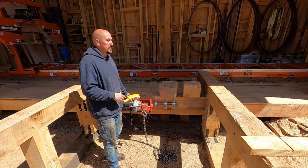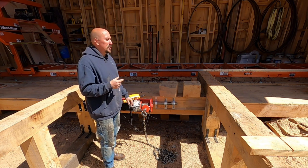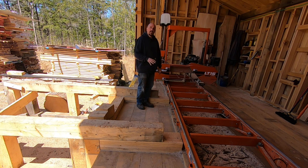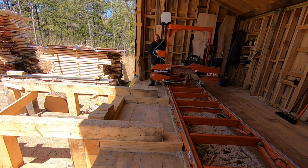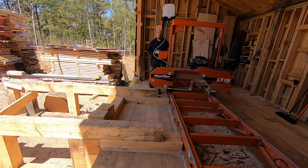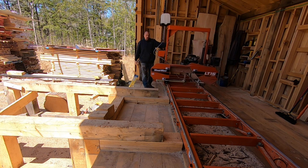This is our second version of the sawmill setup. I'm going to move the camera and show you the last component for rolling logs into the mill. The log road is set based off the height of the carriage and the mill road. This is the lowest setting we typically cut — three-quarter on the mill — and you can see there's room to clear, and the bar guide has no issue clearing the log road. One of the key components is making sure you're not too high; if anything, we'd rather be low.